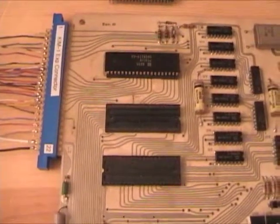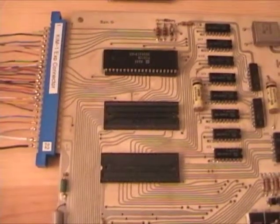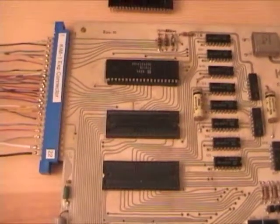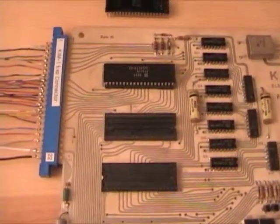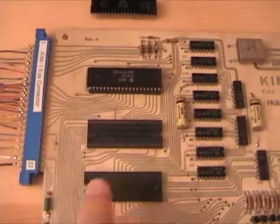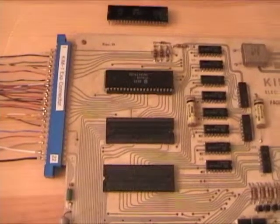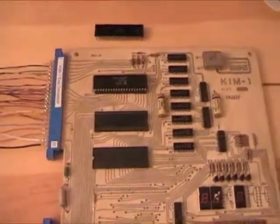So one of my projects is to replace that with a similar part that has no ROM, add an EEPROM as well, and make a daughter board that will go on top of here. But this first test I'm about to show you is just a CPU test.